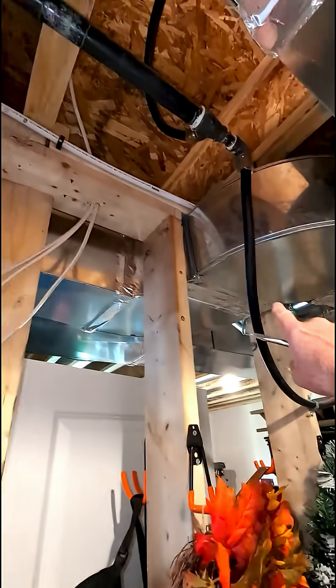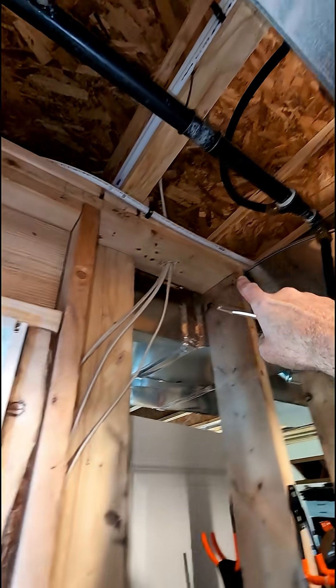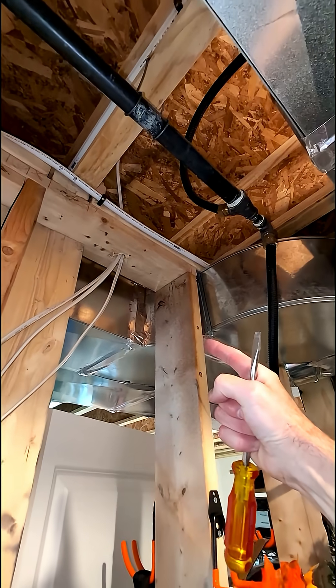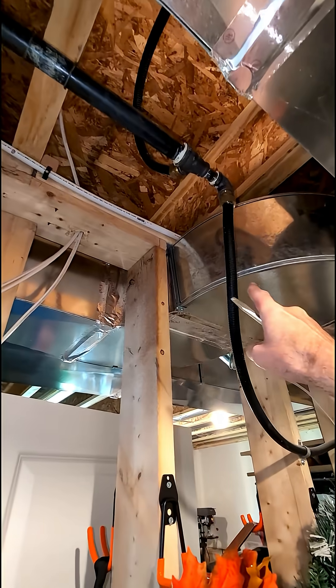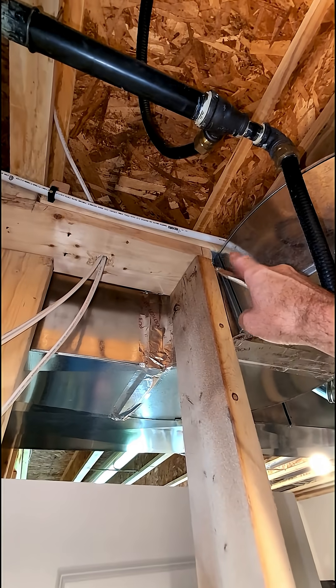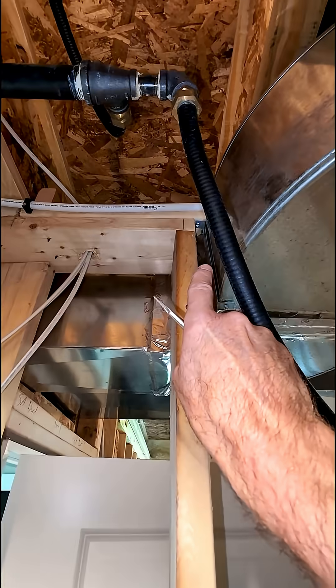Under this load-bearing wall — see — double top plate, header, trimmer stud. You've got the I-joist, but they're not designed to go the full length. Some of them are designed to have a load-bearing wall under them. And then the heating contractor cut into it also — they took that top plate out. It's a double top plate, so they took the lower one out, which now compromised that area for the load.